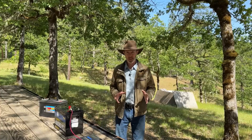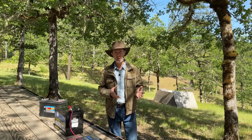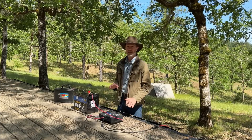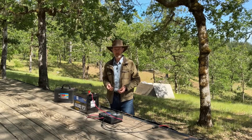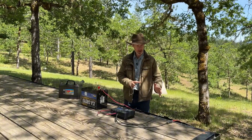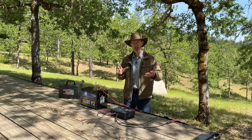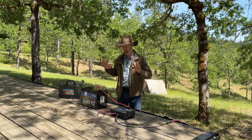One technical thing: look at the back of your solar panel for the plaque showing maximum voltage and amperage your panel can produce. Make sure that doesn't exceed the maximum voltage and amperage your charge controller can receive. For a larger system, make sure the amperage the charge controller puts out doesn't exceed what the battery can take — though with a small system like this you typically don't have to worry. I'll put links in the description for the battery, charge controller, and tools I used. All the other things about solar are simple — we just need to learn one thing at a time.